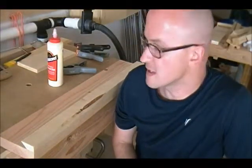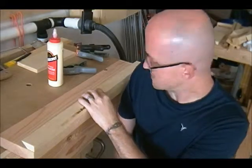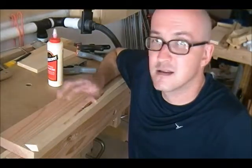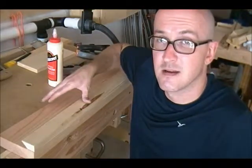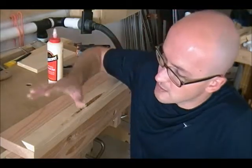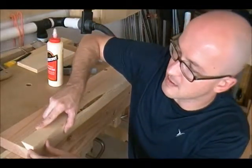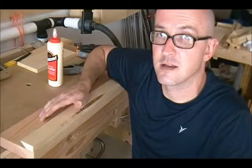So now we're ready for the glue-up. I've got both sides faced, and I also faced the cleat, so that way it'll rest nice and smooth against the 2x6. That will give me pretty much everything I need to put it up on my wall. The only thing left after this is cutting the dowels and putting those in place. One thing to keep in mind as you're gluing up — go ahead and have your clamps ready so you're not hunting for them while your glue is already setting up. I'm just using regular yellow wood glue. Also remember that when you put this on, you should not actually see the angle — you should see the flat piece on the outside. Make sure you've got it facing the right way before you glue it and screw it down.